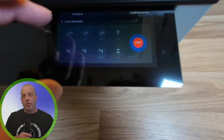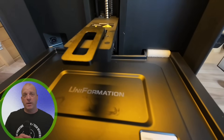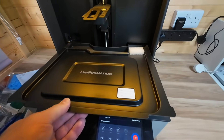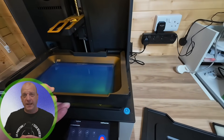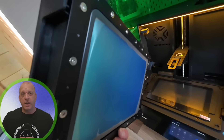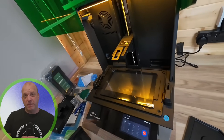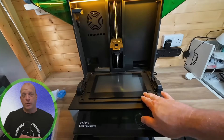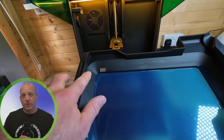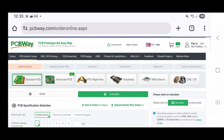Using the Z-axis tab you can lift the build plate holder and remove the VAT cover. The resin VAT is surprisingly lightweight and features dual handles and a pouring spout — a big improvement over other brands. The GK3 Pro uses a CPFA film for smooth peeling and longer-lasting prints. Paired with the 16K display and 385nm UV light source, you get razor-sharp detail. You can test the light source directly from the screen.